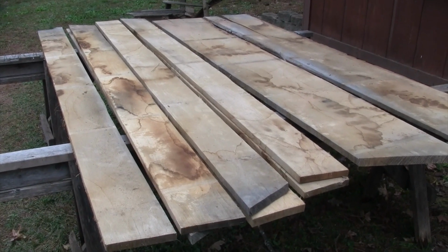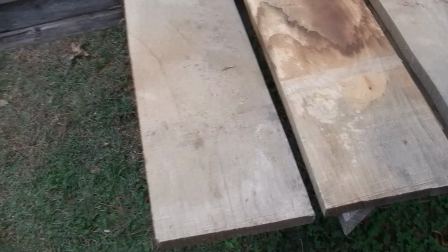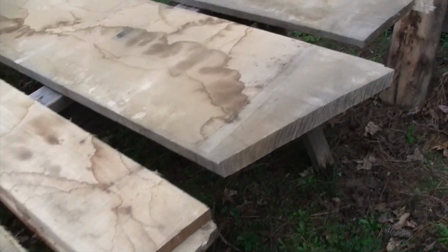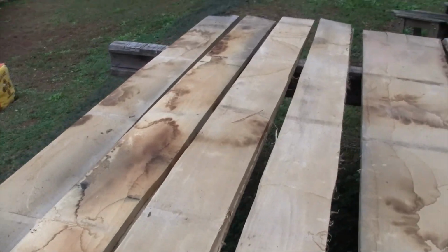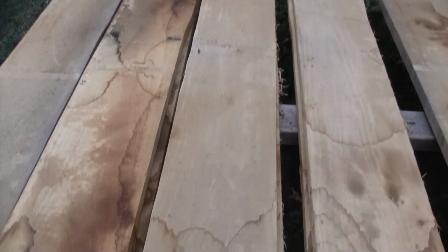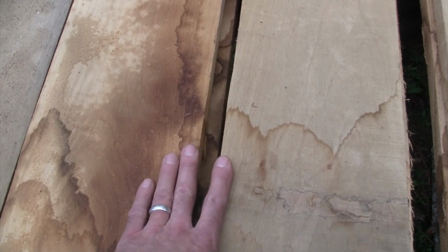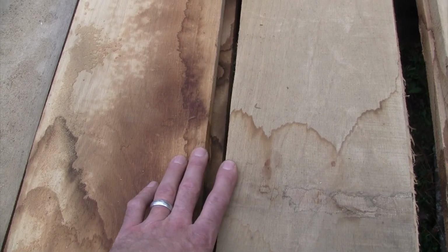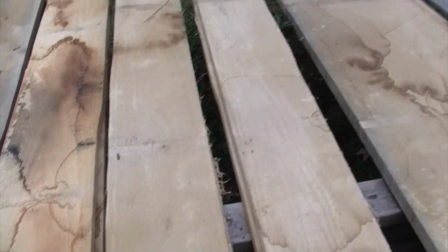So I sourced some white oak from a local custom sawmill. So this is 4/4 rough sawn white oak. So I think this is going to make a really nice bed. So I've got to get to work on getting this cut to length and then get it planed down. Get the dado cut on each side of the board once I get them sized dimensionally. There should be roughly about 7 inches wide, 8 boards. So get the dado cut for the bed strips, and then we'll hopefully be getting this bed in here soon.